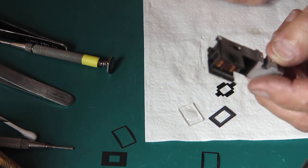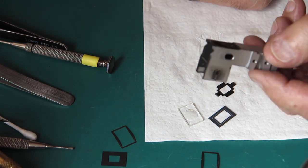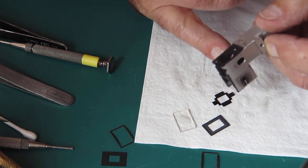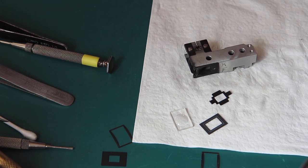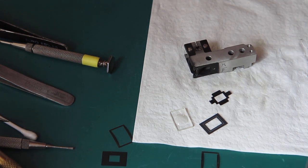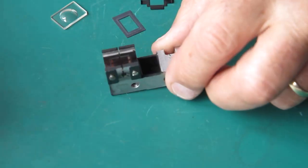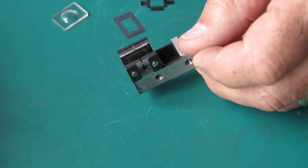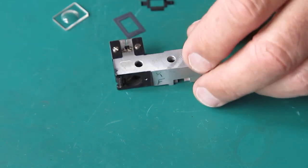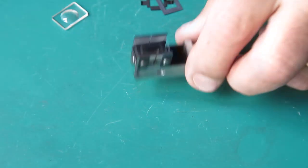I'll put that little bracket back on there to hold them in place and run the screw in — that's ready to go in the ultrasonic cleaner now. It doesn't get long in the ultrasonic cleaner — I'll typically give it three minutes. The glass is all fairly clean anyway with the exception of the semi-silvered mirror, which looks a little dusty but certainly not bad. I have the rangefinder body back from the ultrasonic cleaner — all these parts are nice and clean and sparkly, and I've got to reassemble this.